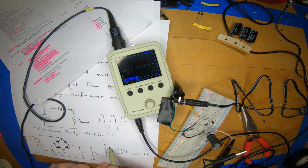When we put the capacitor in, the current starts to, it charges up, but the capacitor has some time it discharges, so I'll exaggerate it like that. And it pops up, and then as it drops, the capacitor starts to discharge like this. We recharge it, etc. So our final waveform ends up looking something like this, and this is the source of some of the ripple that we observe. A large enough capacitor with a big enough time constant means that the drop is increasingly small, and this really flattens out pretty nicely.